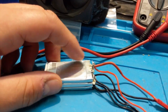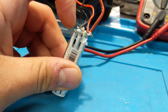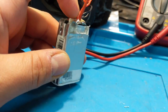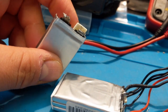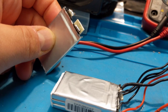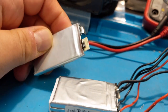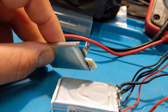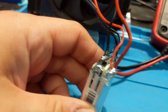With the battery torn apart, the first thing you want to do is heat up the ends and split them apart. This is probably the toughest part of the whole build — putting a hot iron to it and splitting the tabs. Don't cut them because you'll lose the tab portion and we need those tabs to attach cells to each other. Just heat it up and pull apart one by one — it goes pretty quick. I used 800 degrees Fahrenheit. If you go lower, you'll heat up the cell too long and might destroy or overheat it. If you're not experienced or have a cheap soldering iron, don't do this.